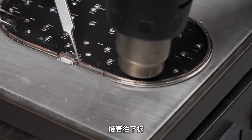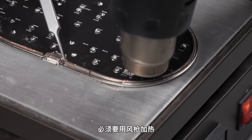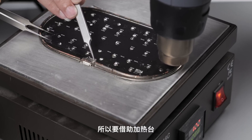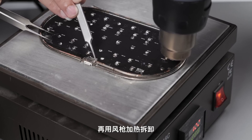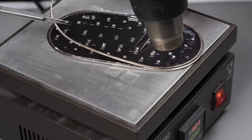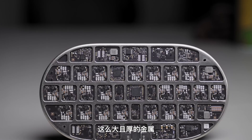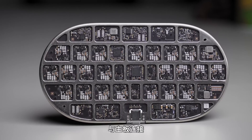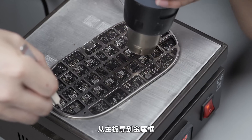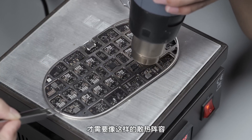Moving on, since the metal frame is soldered onto the board with tin, we need help from a heat gun. The large area of metal dissipates heat quickly, so we use a heating station to stabilize the temperature, then use the heat gun to remove it. The backside is even more crazy — such a gigantic piece of metal is also soldered to the motherboard. The heat generated by the coils and chips is conducted to the metal frame. I wonder how much power it draws that it needs such heat dissipation.